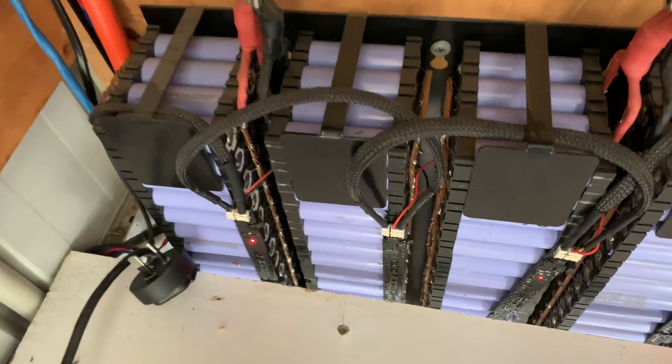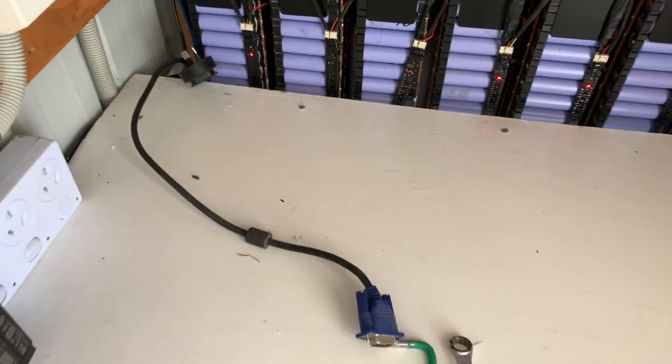I've got all my fans running through it as well, so I have to turn off my Batrium. I'm going to disable this pack now, take it out of service — I've got more than enough on the other side in the other shed to cover my loads. I'll pull the power out of the Watchmon and then turn everything off. The battery placement is a little bit hard to get to so I moved the bench out of the way, then disconnected the cell monitors.